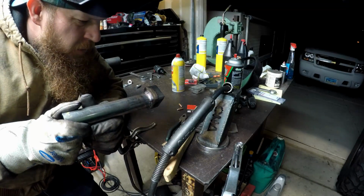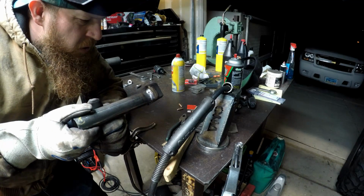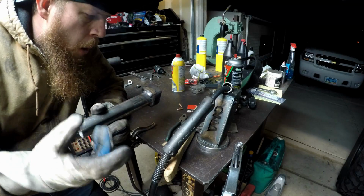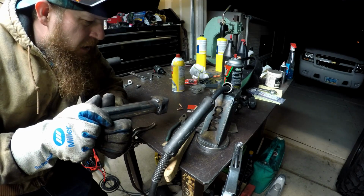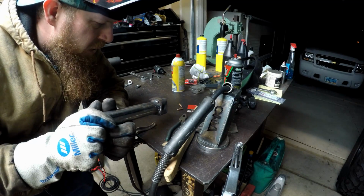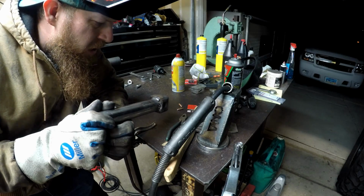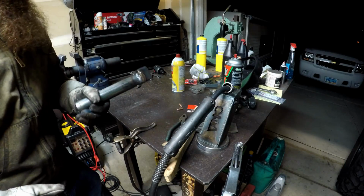Alright, that welded way better. And I got a huge porosity. I watched it just kind of bubble up out of the metal. It seems like dragging it, and that 3 and 60 was actually really good, and it sounded way better. And it certainly didn't spatter or get near as violent, so I'm not sure about the porosity. I'm hoping that's just from some junk that was down in there before.